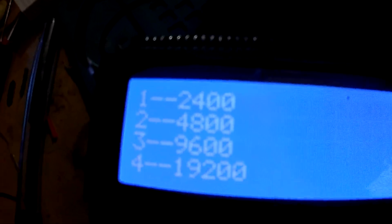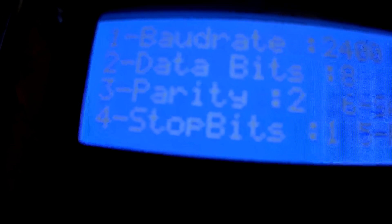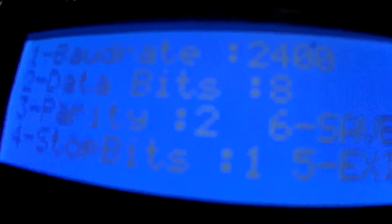So what we're going to do here is change our baud rate to 2400, change the data bits to 8 — 8 works better anyways. I still have not got the debouncing right on this. I'll do the parity; parity has a number assigned to none, odd, and even — let's change it to odd. And then for our stop bits we will use one.